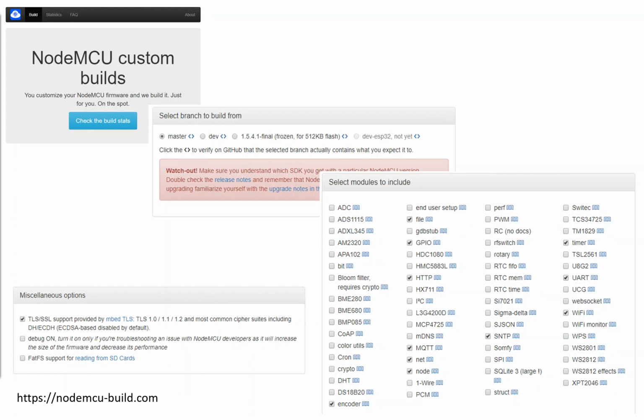Even if you're not going to do certificate checking, just at least send it over a secure channel, just so people can't intercept the data. One of the common misconceptions about these boards is they're not secure, that they don't have modern encryption. Well, the boards do support TLS 1.2. Sorry, no TLS 1.3 support yet, but maybe it'll come eventually. They do support a very limited method of certificate checking as well. You have to give it the root CA and it goes and checks against that. It consumes a lot of flash memory, of course, but you can still do it.